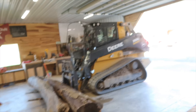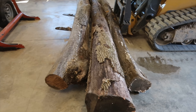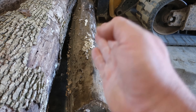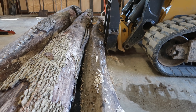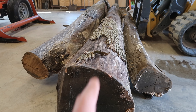However, I do not want to use that spruce touching the concrete. Normally in construction, you use treated pressure wood when you meet with the concrete. The next best thing I have — which is probably better — is white oak. So I went down and retrieved some white oak logs. This will be our sill plate, the two-by-fours that actually touch the concrete down in the horse barn. After further inspection, this particular log — the grain rolls around, and once I would cut that into two-by-fours, it's immediately going to start twisting really bad.